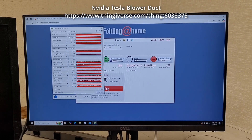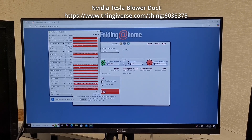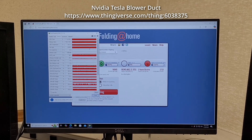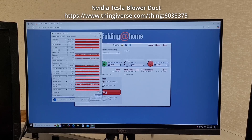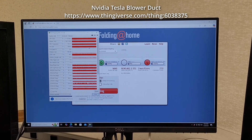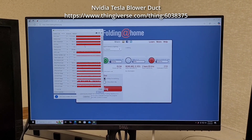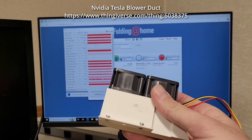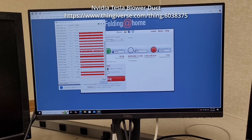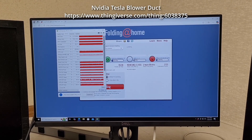This third shroud has been running for a while. We started at 35.9°C and it's been hovering around 89°C for the hot spot. Surprisingly, this one didn't perform as well as I expected — the blower fan should be able to move more air than the 40mm fans, but it might have to do with the design of the shroud since it curves around. There are no performance caps or thermal limits being hit, but it's on the verge and would probably start thermal throttling if ambient temperature were a bit higher.